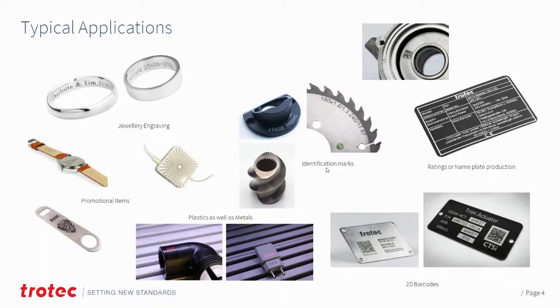It's very extensively used in industrial marking, because unlike printing it on or any other stickers or tapes or anything, you're not applying it onto the surface, you're physically changing the surface. So it's going to be there for the lifetime of the part. You have to really physically remove that top layer of material to get rid of the mark. So oil and gas, aerospace, automotive, all kinds of industries where permanent part marking that needs to last decades is required, and these kind of machines are ideal for that.